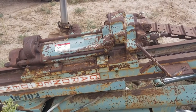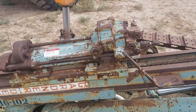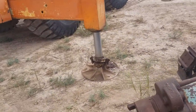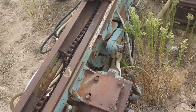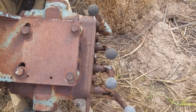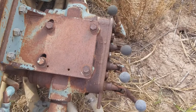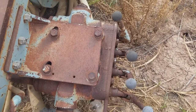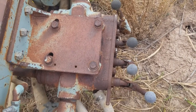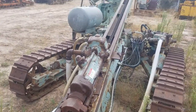PR231B signifies that it's a pneumatic reversible hammer — in other words, the rotation can be reversed independently of the drill power. The controls include: rotation, which is just that; blow, which with hollow core drill steel allows you to blow compressed air down the drill steel to blow cuttings out of the hole; drill; and feed.